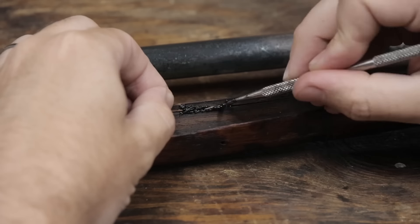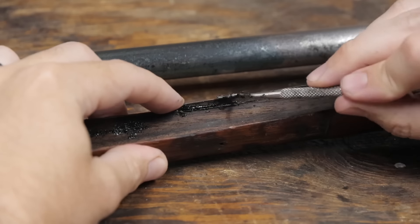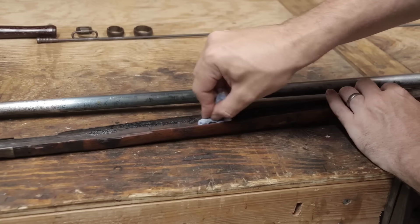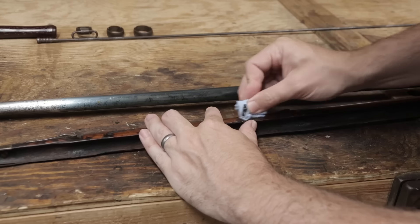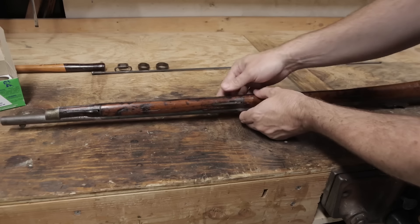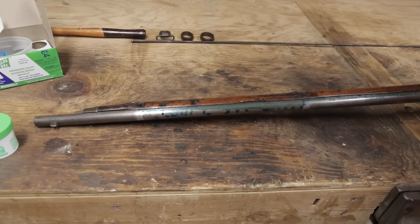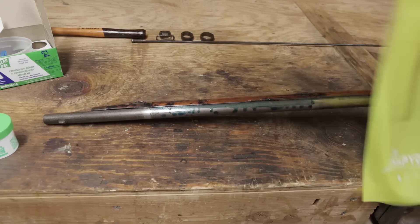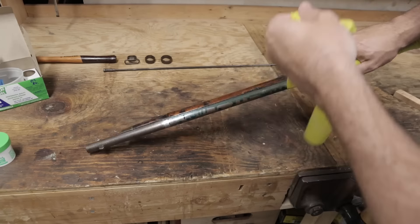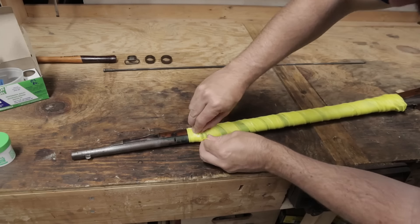This smaller crack is much easier to push epoxy into since I can just lift up on it. Before leaving this to cure, I'll remove any excess epoxy from the inside and, more importantly, the outside — I'll wipe it down once more. Then to hold the cracks closed and everything in place, I'll wrap an exercise band around the whole fore end. I'm pulling it as I go and wrapping it around this way so that it will pull the cracks closed. At the end I'll tuck it in, and then leave this and the stock for a few days to cure.